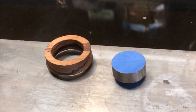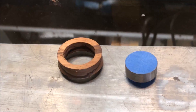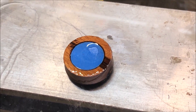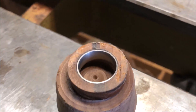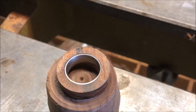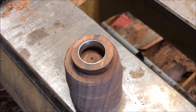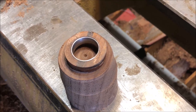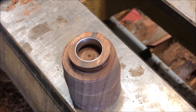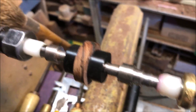I've scuffed up the outer edge of the ring core just a tiny bit. I now have both sides blue-taped and trimmed, and I'm going to put some thick CA glue in there and let it cure up naturally — no accelerator. I got some CA on there. Even with the blue tape I still got a little glue down inside, but I was able to clean it out using a wooden scraper and a Scotch-Brite pad. I should have let it dry a little longer — there was still some residue from the zip-kicked first layer.